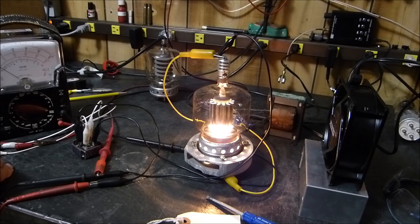I've heated the plate up, I've done everything — I can't save the tube. The tube is bad. But the good part that's come out of this story is: if you do this on good tubes and run it up to 100 volts, it hovers steadily and never rises to a ridiculous level.